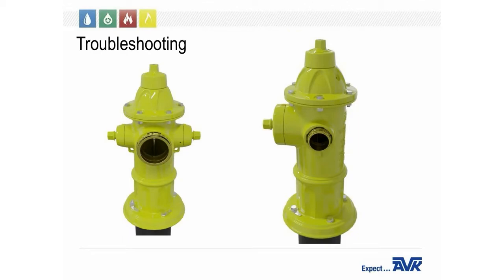After the hydrant is closed, make sure your weep holes are functioning and the hydrant is draining. This can be done two different ways. The first is visual — remove the pumper cap and see if the water is going down. The other is to remove a hose cap and place your hand over the nozzle for 10 or 15 seconds, then pull your hand away. If the hydrant is draining, you should feel the suction. If your hydrant is not draining, blow out the weep holes — we will get into that a little later in this presentation.